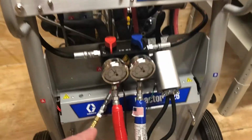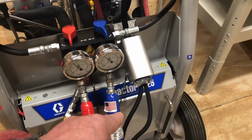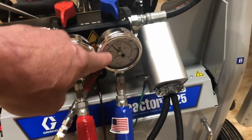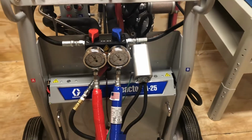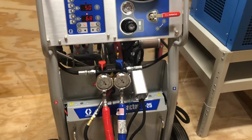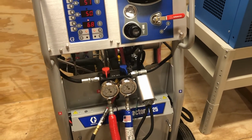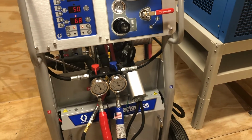So if you think of the A side, and I think I might have already covered this, as being Coca-Cola, and that being a Wendy's Frosty, and you're trying to push material down it, it's absolutely going to take more pressure to push the milkshake through than it is the Coca-Cola. The Coca-Cola is just going to flow out of there. Because of this, you're going to find on a traditional single drive system that you're probably going to have to buy a drum of ISO about every 9 or 10 kits of foam. And it's just a viscosity issue.